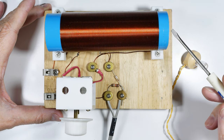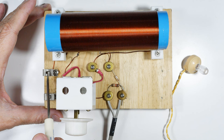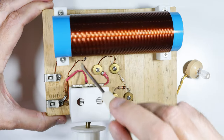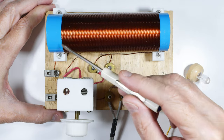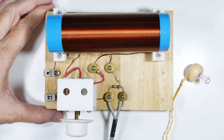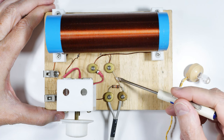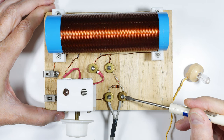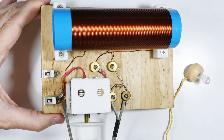The middle-sized one was a two-inch coil and the big one was a three-inch coil. Let's do a walk-around. This is the antenna connection — the antenna comes in here, passes through 20 turns to this tap, and this tap goes to the ground. So this is a tightly coupled system. The antenna has its own set of coils — still attached to the main coil — but a lot of the energy passes directly out to ground. Then we pass through 30 more turns to the next tap, which is where the crystal diode is. It attaches to one side of the earphone resistor, the other side of the earphone, and then a wire goes underneath the frame to ground — that's the earphone circuit.